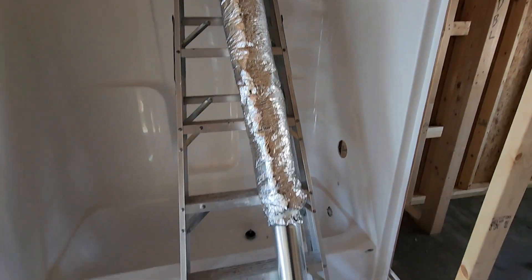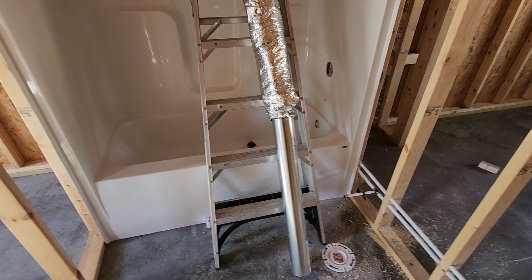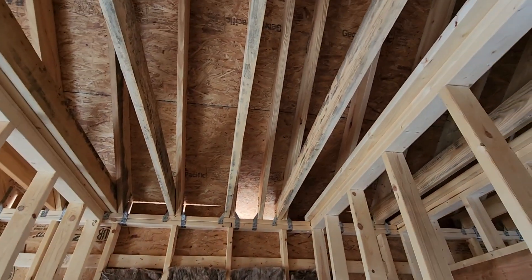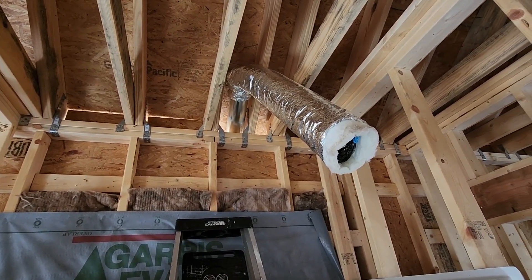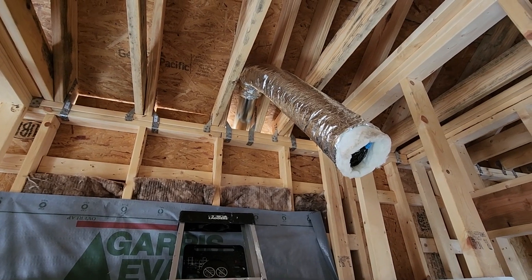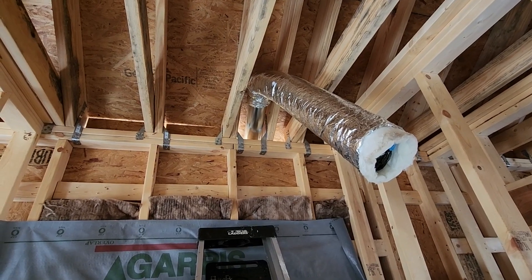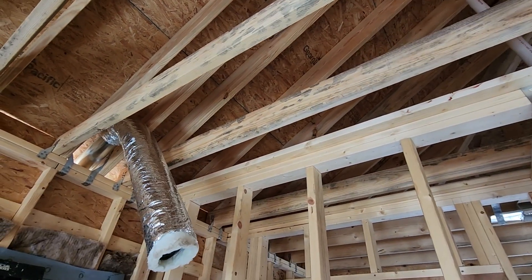I'm not going to do that with my house. It's amazing when you do your own house — you come up with things you're not comfortable doing, and you realize if you're not comfortable doing that for your house, you probably shouldn't be comfortable doing it for somebody else. So from here on out, when I do duct and exhaust fan, I'm going to run hard pipe out to the soffit, and then flex over to the fan. That hard pipe is going to be a solid surface they can spray foam against right there in the soffit. They'll be able to spray foam all around it to get the R-value. The pipe will take up space in that cavity and they may need to build up some spray foam around it, but that's the only choice. Everything is going out of the soffit, and eventually we'll hook up a really high-efficiency fan — more about that later.